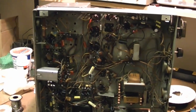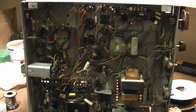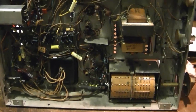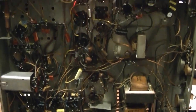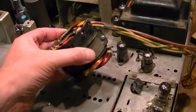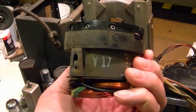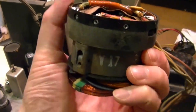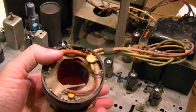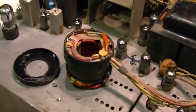I'm finally done with working underneath the chassis, at least for now. Next up I'm going to flip this down and see about wiring in that replacement yoke. So here is the yoke I propose using. One of my astute viewers noticed it has Y17 stamped on the side — it just so happens that if you look up the part number from the K part in a Thordarson yoke replacement guide, Y17 is their replacement.